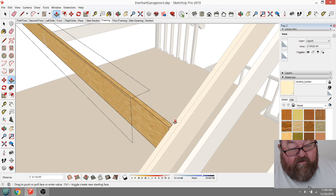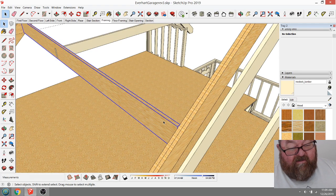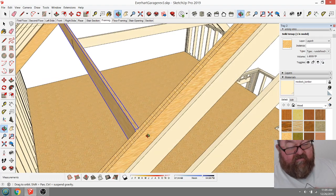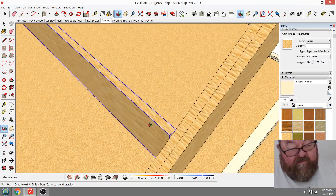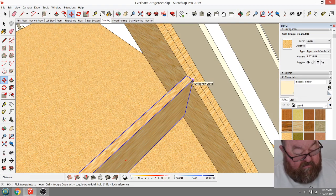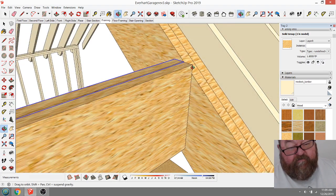It will come over here, and there will be these big anchors, big connectors connecting these LVLs with those LVLs. And let's see, this one would be doubled, so it would be like this. And what you'd have here is a double LVL hanger.